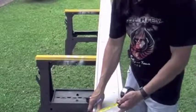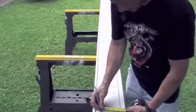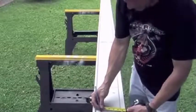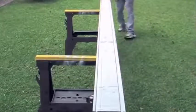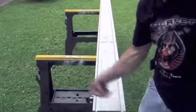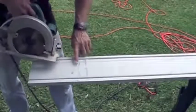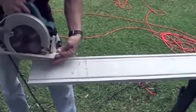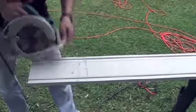This is my fascia board, which is actually 8 inches, and I only need 5 and a half inches for this. So I'm going to set my guide up at 5 and a half inches on my Tracer XL tape and mark my line. Once I have this line marked, I'm going to come back and rip this, and I'll have the perfect size. I'll grab the plate and use my finger as a guide to follow this line, pinch it, line it up, and rip my board.